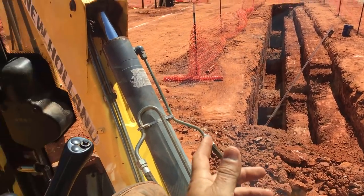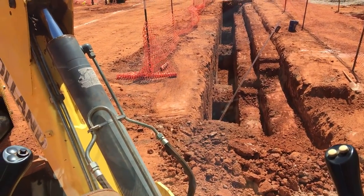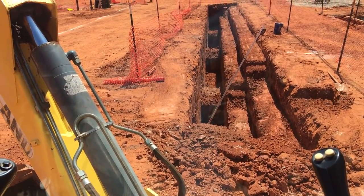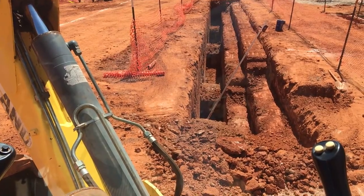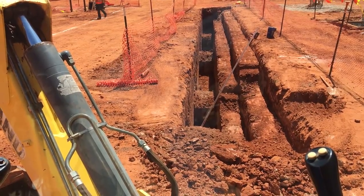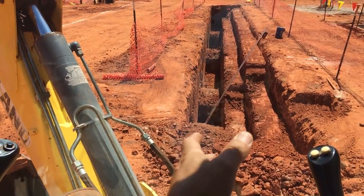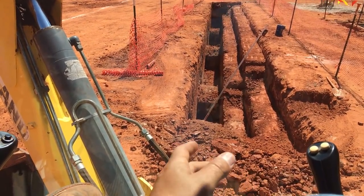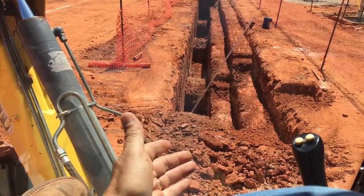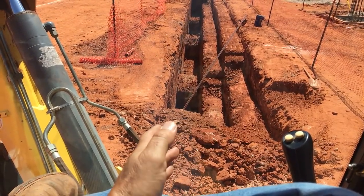They dug another elevator pit over here. They had the dirt contractor dig it out for them. And the guy doing the waterproofing said he couldn't put his waterproofing on it. So they had to go in behind the waterproofing and put styrofoam, and they spent a lot of extra time just dressing up the dirt. So once again, the work I'm doing here is helping out in a couple of ways. It's helping the waterproofing people. It's helping the guy doing the concrete because he's responsible for the hole. And then also they'll be pouring concrete right up against this dirt, so it's a dirt form.